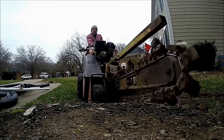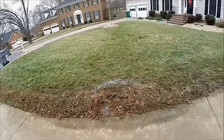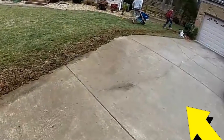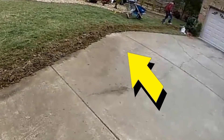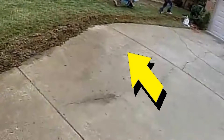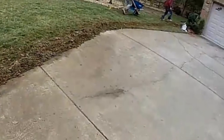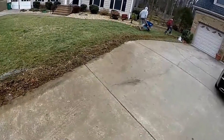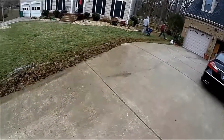It really depends on how that driveway is pitched. Take a look — you can see where we're going to put these catch basins. This driveway is actually sloped all the way to one side. You can actually see it in this photo. When it rains, all the water would pool up on this side of the driveway. You can see the crack inside the driveway as well — that tells you there's a lot of water underneath that concrete.